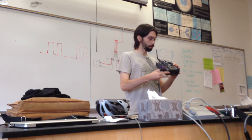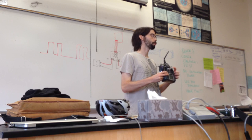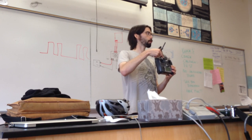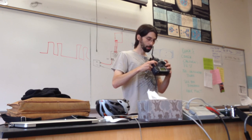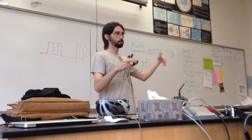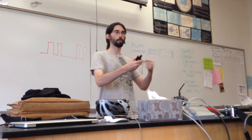So you can map it out that way. For instance, this motion is going to control channel one on the receiver. This thing here is going to be negative 100% on channel one, which means backwards. This one is going to be 100% forwards on channel one. And then this stick will be negative 100% on channel two, and this will be forwards 100% on channel two. By mapping that out, when you move these, the radio will transmit that specific command — the receiver will output those commands — and the motors will be driven accordingly.